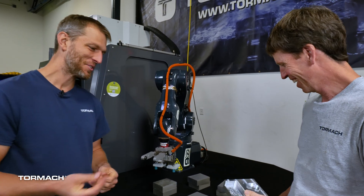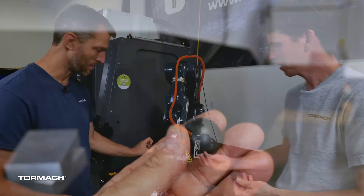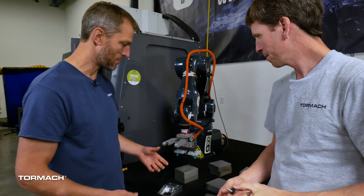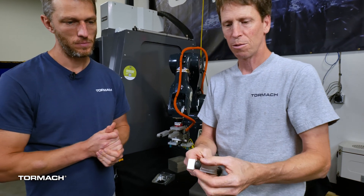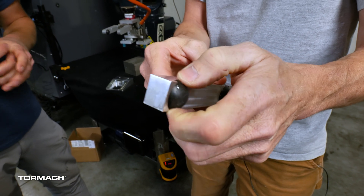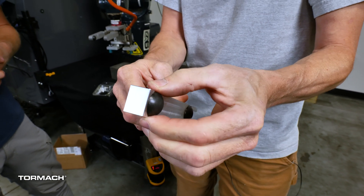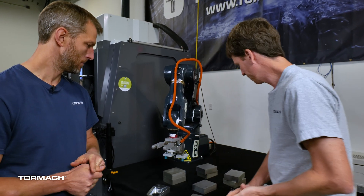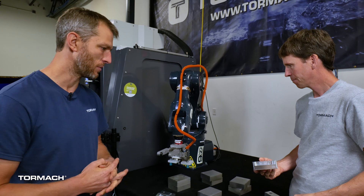And then I see you used one of these rubber feet. What's the deal with the rubber foot? It gives you that little bit of friction, and they're also threaded so you can adjust it. That allows us to put a little bit of preload or tension into the system to give it extra grip and help it locate. These little guys thread in — if you want it sticking further out, you just unscrew it; if you want it sticking further in, you screw it in. They're just an off-the-shelf available bumper, a real simple and low-cost component.